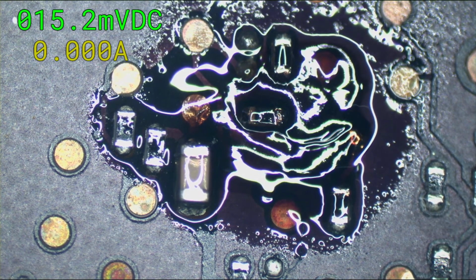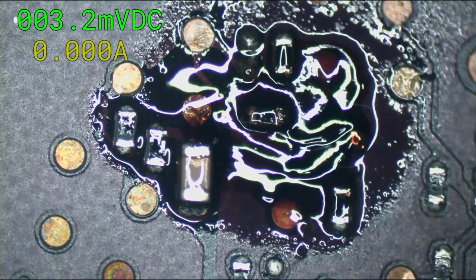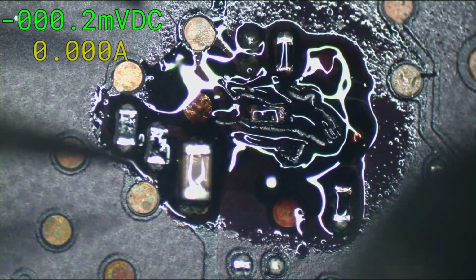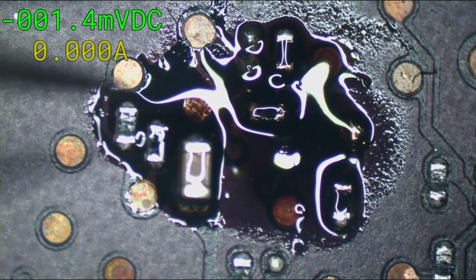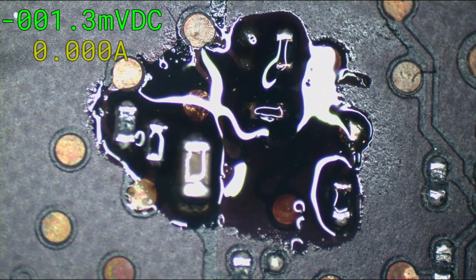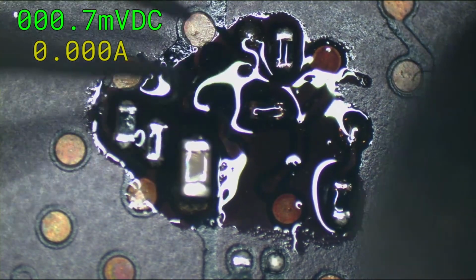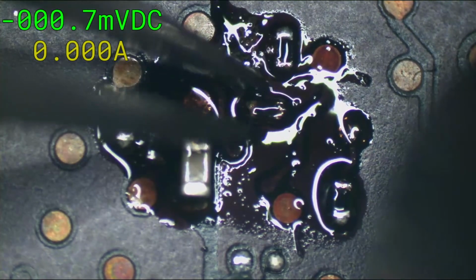What jumper do we use? Our normal jumper size that we have for pretty much everything is 44 gauge. That's like a good middle ground that, for most instances, that's what you use. Now, if you're jumping like PP bus or something like that to somewhere, or you're jumping DC in somewhere, you want something bigger than that. Yeah, how far do you need to jump to? That's also a consideration. What voltage it is, how much current it's taking, and how far it needs to go.